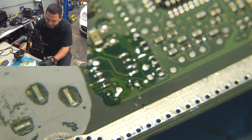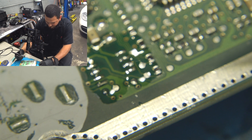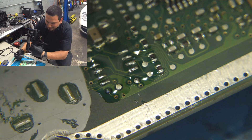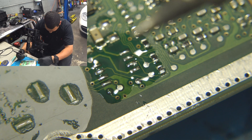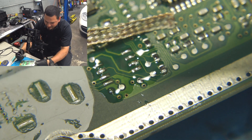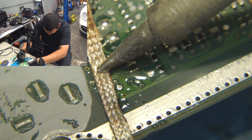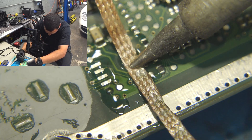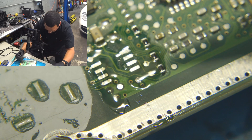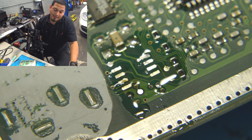Clean them up a bit, make them nice and even. Some people will reinstall right after with hot air, but I don't want to do that — especially for beginners, you won't want to take that risk. My solder wick is used a bit but we're going to the unused portion. You don't need to put pressure — just let it do its job and get them nice and flat. We don't know what kind of solder was on there before.